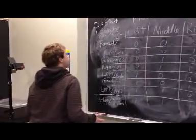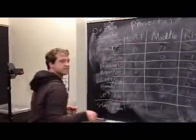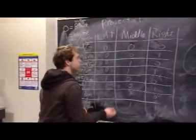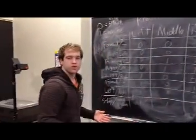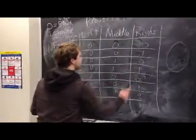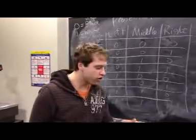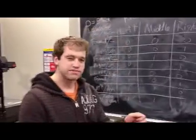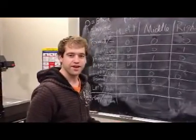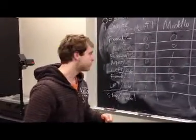Let's look at the other operations. Also avoiding the line, when we get 3 zeros, it senses the tabletop continuously and keeps going. That means it hasn't sensed any of the white tape yet. If on the right we sense the tape, we avoid the tape by going to the left. If we sense the tape on both the middle and the right sensor, we go left even faster. To do this, we had one wheel turn in reverse and the other wheel turn forward to give a sort of torque motion. It sped up the code and really helped our robot avoid the line. We tried both ways and found this was much more successful than the conventional approach of stopping one wheel and moving the other forward.